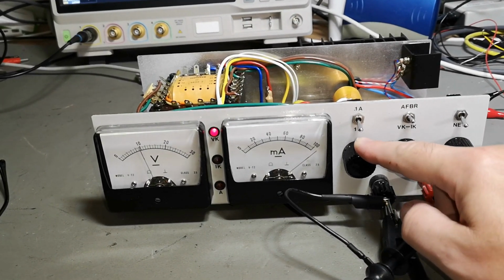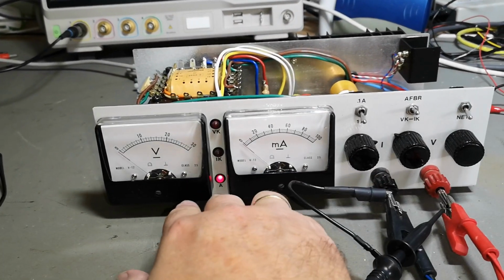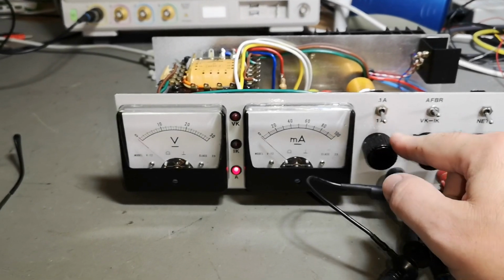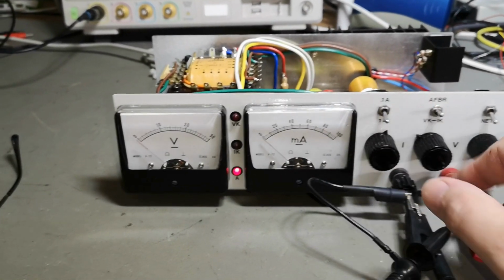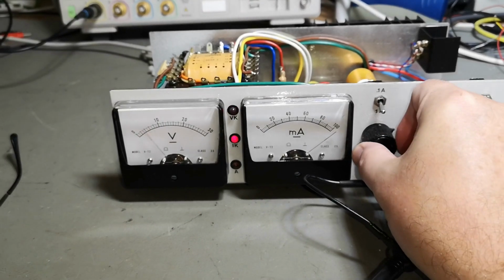Then if I go to, see, constant current mode, then instead of going back into constant current mode, it just folds back, and that is in amp overload mode. So now it's in fold back mode. See? Haha! That is what it is. It goes to total kill. Now I figured this out. And then we can go back on into constant current mode.